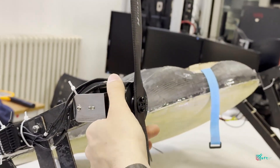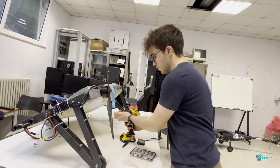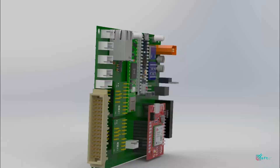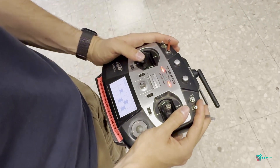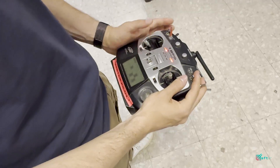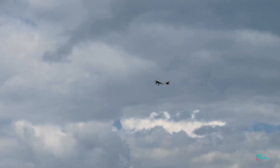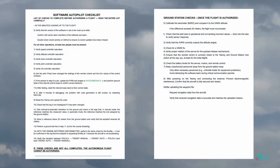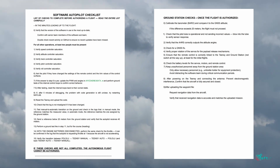To minimize the risk of electrocution and injury from propeller blades, all operational team members are promptly notified whenever the drone is armed or disarmed. We also designed and built a custom PCB board that allows effortless switching between automatic and manual flight modes, featuring a double redundancy system to mitigate any risks arising from autopilot malfunctions. The safety pilot can activate a dedicated switch to completely bypass the autopilot hardware if necessary. To further enhance safety, we created new, more intuitive, pre-flight and post-flight checklists and added software checklists to verify the correct operation of our homemade autopilot software.